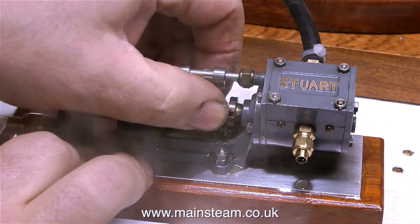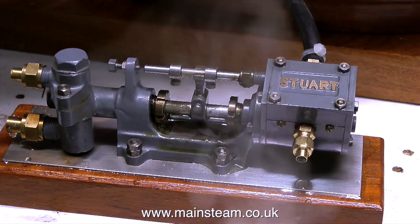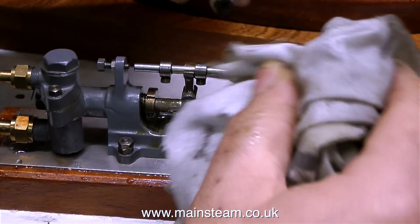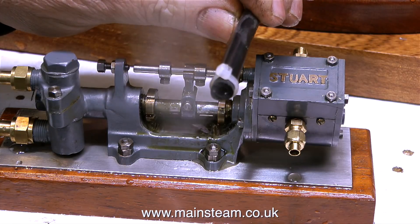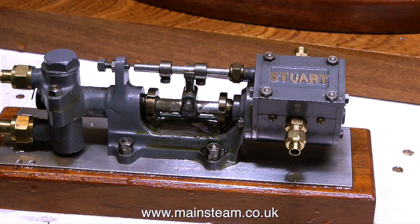I turned the gas supply off to the boiler a while back, so there's not really much steam coming out of this pipe at all. But as I move the piston rod back and forth by hand - which is much freer now, by the way - you can still hear the clicking of the shuttle valve as it goes back and forth in the steam chest. Once I remove the piece of silicone rubber pipe from the inlet and open the steam valve, you can really see how little steam is available in the pipe - next to nothing. So where do I go from here? First I'm going to put the steam pipe back on the original large steam plant, because the customer's picking that up tomorrow. Then I'm going to run this engine in a little bit more using compressed air, after which I will fit it to the 7a steam plant. But that's it for this one - thanks for watching, and I hope you found it useful.